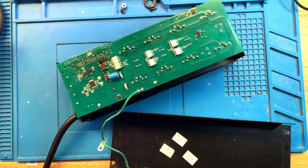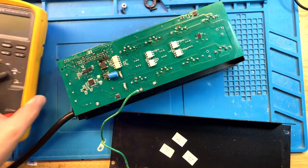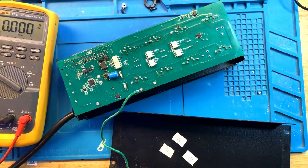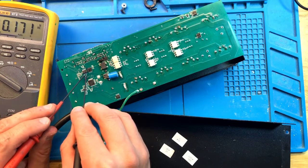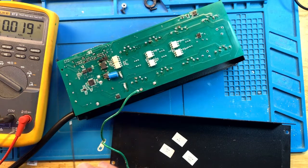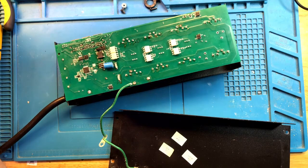I'm gonna plug it in, see if anything smokes. Let's see if the lights come up. And if everything checks out, we'll see if it connects to the Apex. The power is on. Let's test some voltages. I'm expecting 5 volts. Perfect. I'm not seeing any smoke, I'm not seeing any fire, I'm not seeing any sparks. The LED light is blinking orange. Can't show it, unfortunately, because of the angle, and since it's plugged in, I don't want to touch it much.